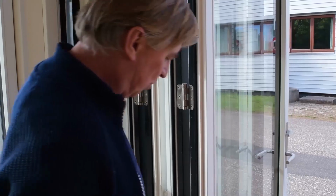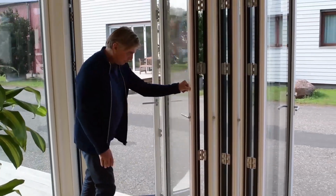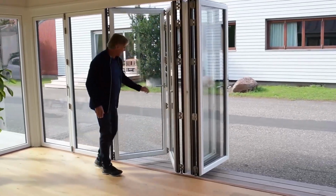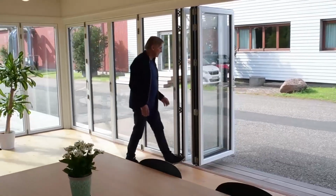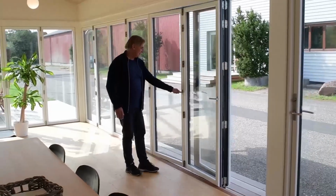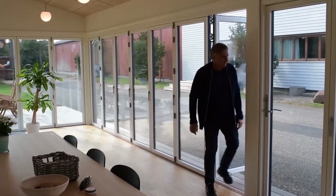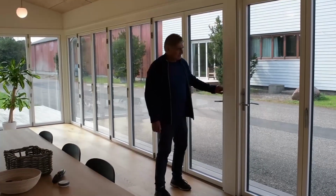In addition to the Thermally Treated Beech, also called TMT composite, which is used for our panels as the predominant painted solution, we also offer our folding doors in FSC certified mahogany and European oak. All of our folding doors are manufactured after the same standards. All Lacuna folding doors are of course available with 2 or 3 layer glass solutions. Even the insulation level can be adjusted to, for example, match passive house norms.